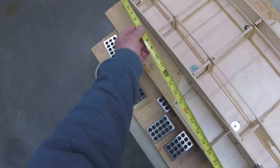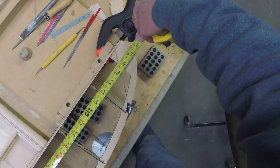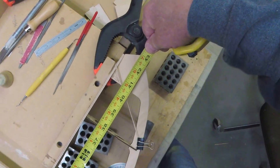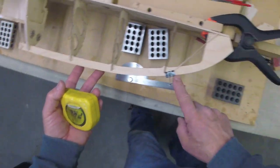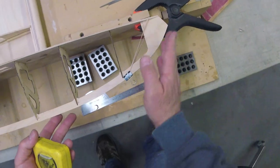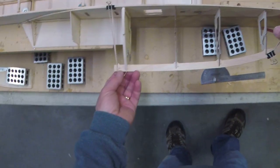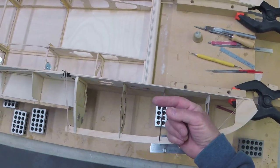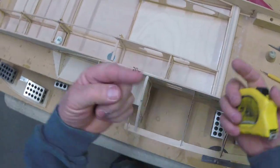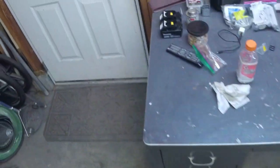We're allowed — is it 43 inches? I think 43. Can you see that we are at 43? It comes a little over 43 and a half. This sponson chine here I have cut and reshaped, and this piece has been cut and reshaped — we'll talk a little bit more about that in just a minute — to get the boat the proper length. So what do you think that means for the width? Too wide.